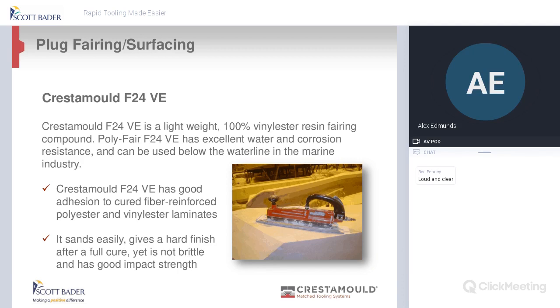If we look at our competition in the marketplace, the SG on our product compared to competitors is 0.7, and most of the body fillers I've seen in the marketplace at the moment are 1.1, 1.2, so it's lightweight, so it's good when you're doing these kind of products. It can be used not just on your tooling, though, it can be used on mold repairs as well.